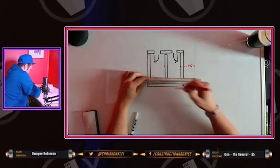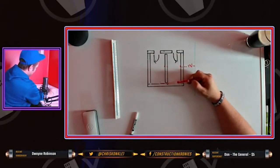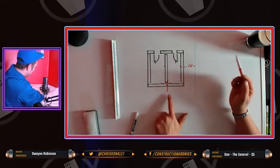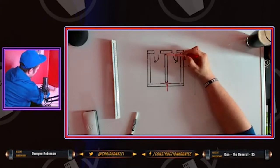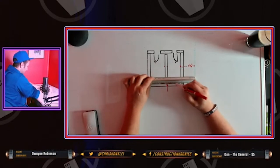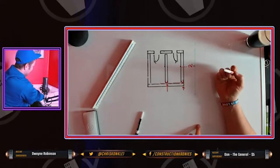What I mean by this is you want to plan a sheet of drywall to start basically in the middle of the wall. This wall isn't going to be framed tight into this wall or that wall — there's going to be a floating stud there. When the drywall is in there, you're gonna then put the stud tight to the drywall and screw it in from the back side. You're gonna do that there, and here, and also in the corners. You'll do 48 inches, then your cut-in or whatever. Put the stud in tight at the corner and screw it in from this way. That's how it works.